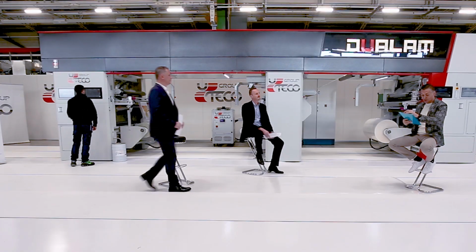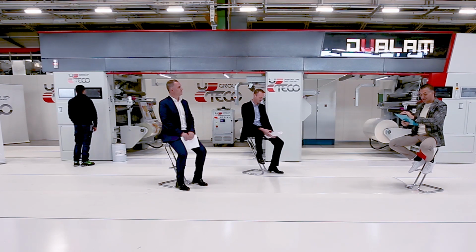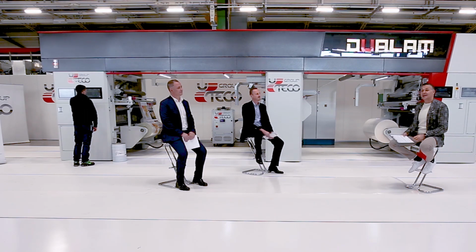Thank you, Alessandro, for your description. Let me remind you that in today's demonstration we will laminate a PET 12 micron thick film with an LDPE 20 micron thick film using solventless adhesives, DCI 017A and DCO 005, developed by SunChemical, which will be described now by Pierangelo. Thank you.